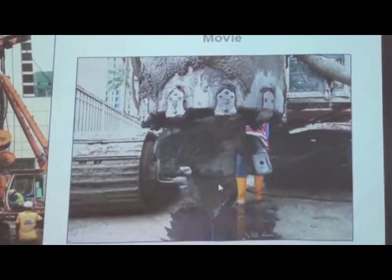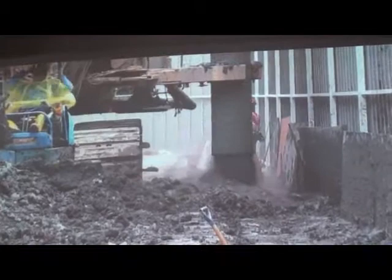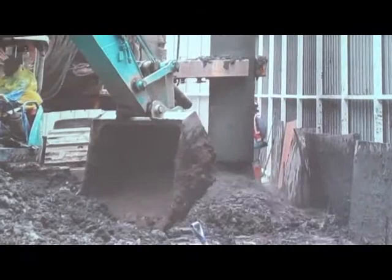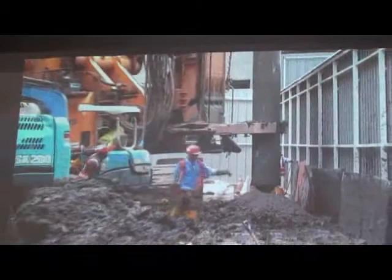You can see, after you finish the pile drilling and concreting, still a lot of soil and even rock remain inside of the casing. That's why we have to discharge. For such a tight space, how to remove this drilled material, soil, and also rock is very important to have good production on the job site. So nowadays, especially in the city area, not only the drilling and concreting, the removal of the spoil is also a big concern. So, in less than 1 minute, empty all these materials, then you move to the next point.